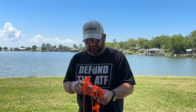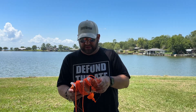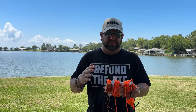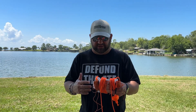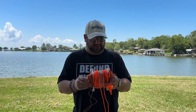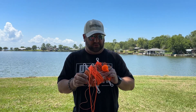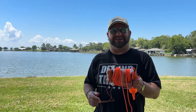The first part is to unwind this without getting it any more tangled than I already have. I believe we've got about 30 feet of homebrew twin lead ladder line kind of stuff, and then I think 45 feet maybe for each leg of the antenna wire. Once I get it all figured out, I'll show you.